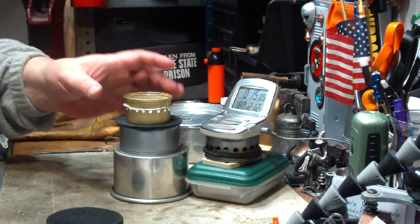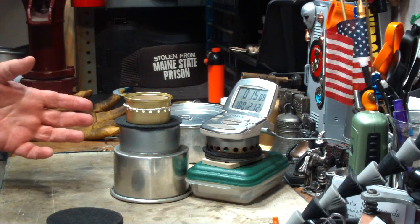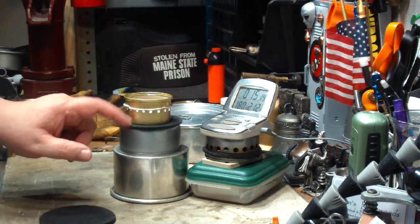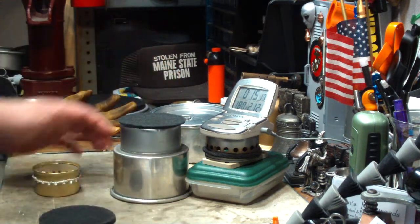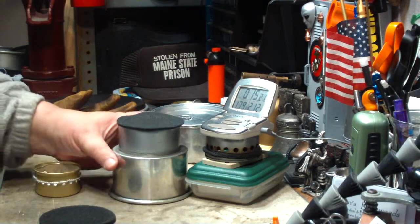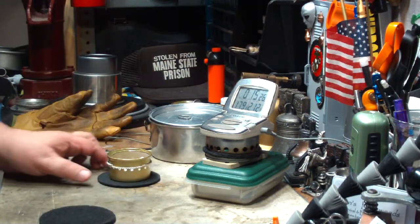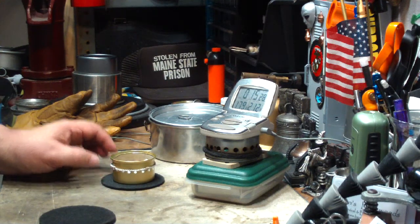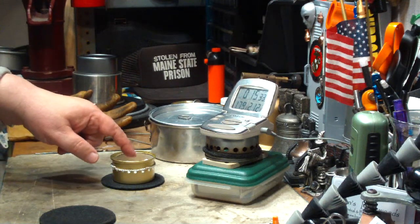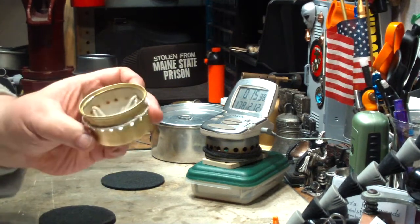So this didn't go quite as fast as I thought it would. But I've had a couple of suggestions from people for other modifications. One was to use carbon felt underneath this kind of burner, to isolate it from cold surfaces. This is just built up because I needed it for the camera, but normally it would be down with the stove or burner on top of it, to isolate the cold of the table or ground from affecting the burner. This kind of burner is really touchy when it comes to cold.